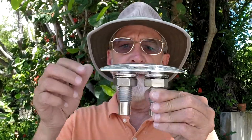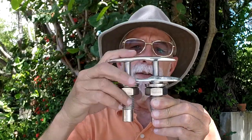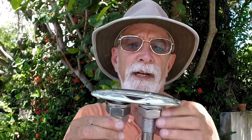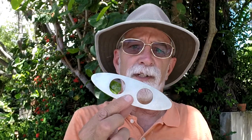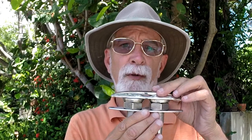This is a pop-up cleat, as you can see here. It also has drain tubes to collect the water that comes out through the area where this slides down, so it can be channeled into an area — which I'm going to channel into the anchor locker to run to the bilge. I also bought a couple of backing plates to give it a real solid hold on the deck.